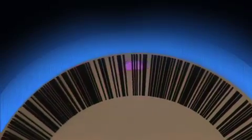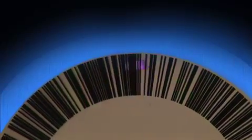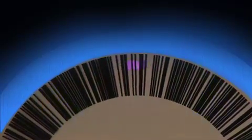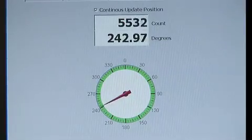The controller transmits a burst of light to the sensor. Inside the sensor, a coded disk modulates the spectral components of the light. The position information is now imprinted in the optical spectrum of the light and guided back to the controller for position readout.